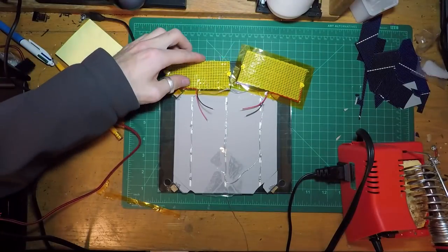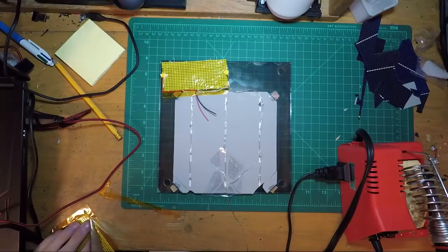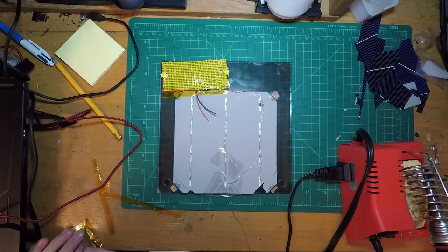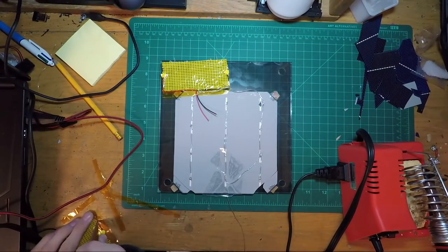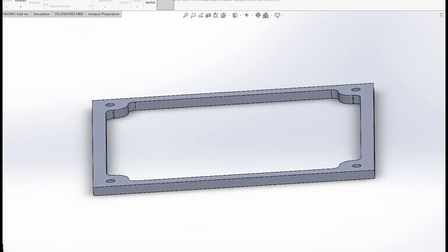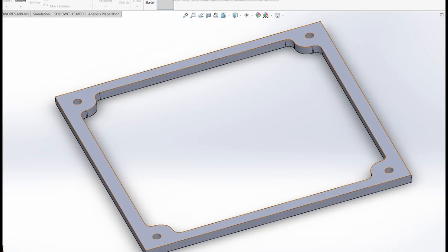Roof heating is another feature we can expect for roof tiles in snowy climates. For this, I simply added some heat pads. I wasn't too worried about where I put the pads, since glass has a high thermal conductivity, the heat will spread over the glass and uniformly melt the snowpack. This gasket I designed allows the panel to be sealed from the elements by another tempered glass panel.